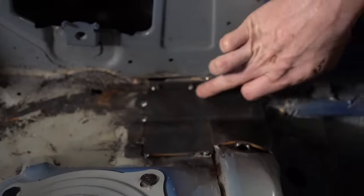As you can see, I have the dimensions on the outside of the tube. That's because I measured to the inside of the chassis. Outside of the tube meets the inside of the chassis. You can also do center line, or you can do inside dimensions, depending on what you're using this layout for. But for this, we're using the outside dimensions.